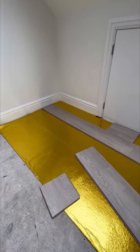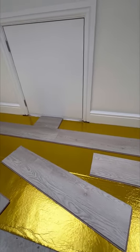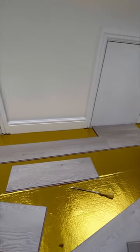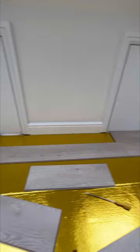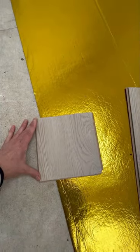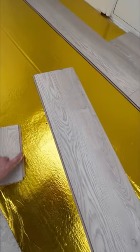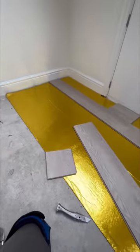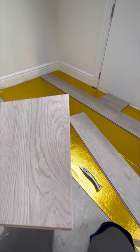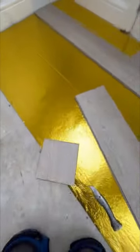What we're doing, we're setting up where we just cut the architraves. So we're going to back mark it into the shape of that wall. In order to do that, we need a marker board. Cut a quarter off of a full board, and then we'll cut the sides down and then we'll show you how to back mark in. So just cut that big tongue off with a Stanley blade to snap it. And you've got a nice section.